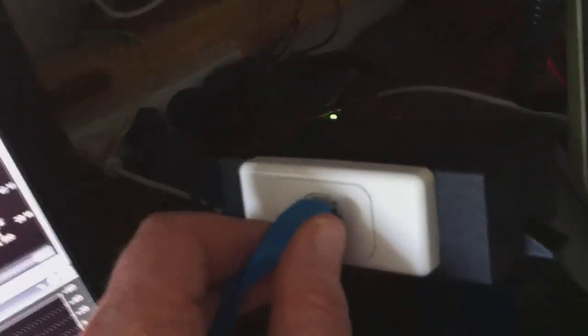And it was getting a bit messy with cables everywhere, so I made a breakout box. So I've got a Jiffy box here. I put an RJ45 face plate, architrave plate, whatever you want to call it, on one side. And two, ooh, that's dark as a dark thing, isn't it? Two 3.5mm plugs on the other side. So now, the only thing is, because I'm plugging into the MFJ DSP filter, I've got to have that box there. I can make a longer lead, but it's all good.